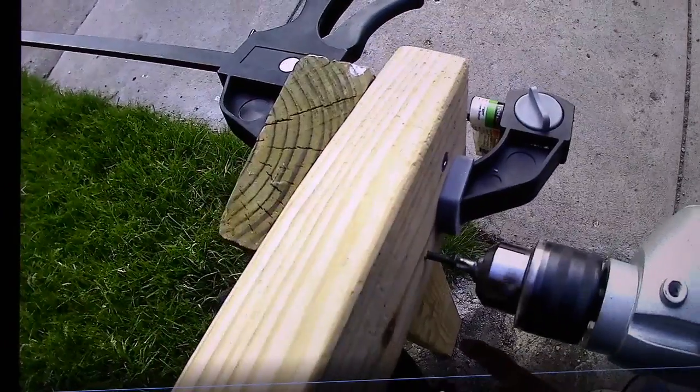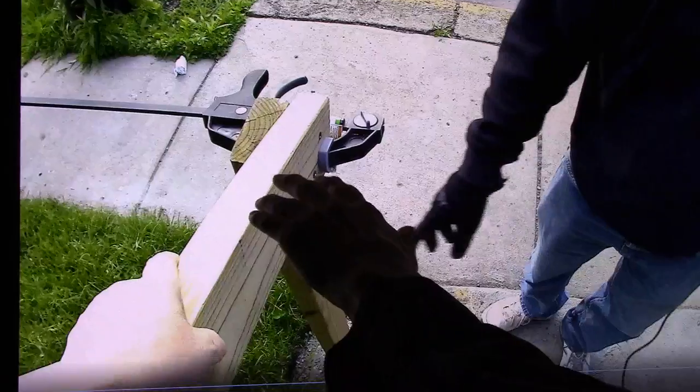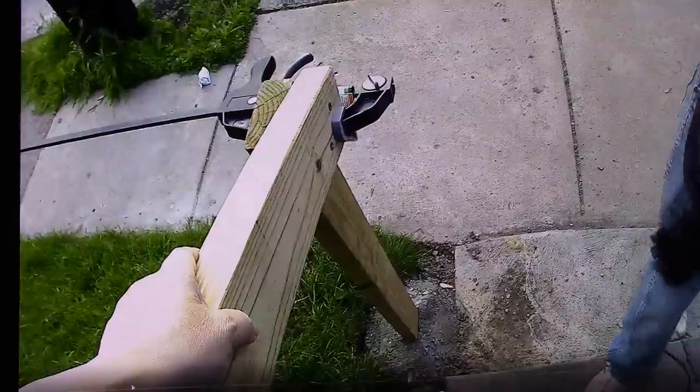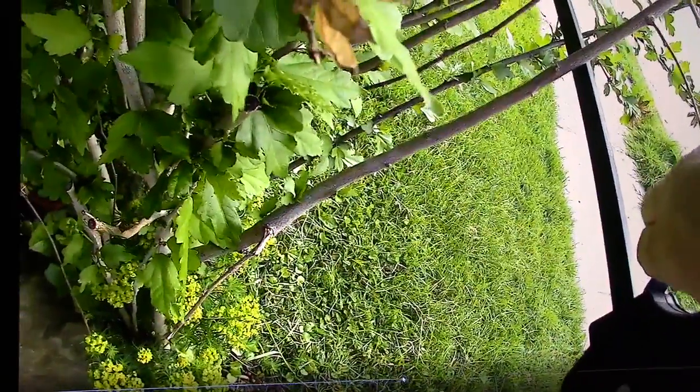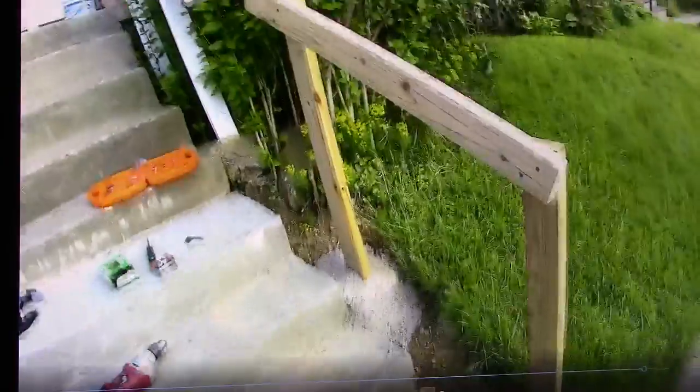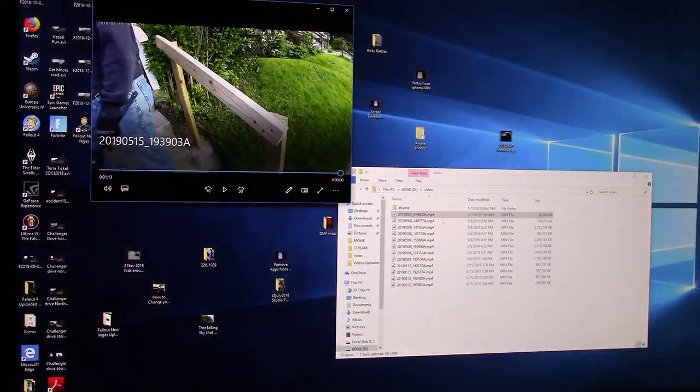Now you've driven four screws and you've got your handrail. You can see how this dried — there's not a lot of gap, which is nice. These things are really in there: a foot and a half of post underground, three feet up, and your handrail is perfectly secure. Taking the clamps off — she had a little trouble with the release. Common mistake: don't hold the tensioner at the same time. Just hold the grip and pull. There's the final product — I'm pushing on it pretty hard and it's solid. This is about three days later after some rain, and you can see the slope so the water runs off.